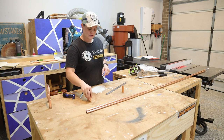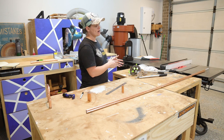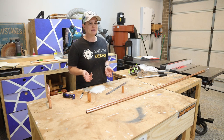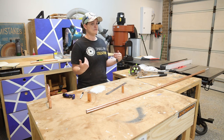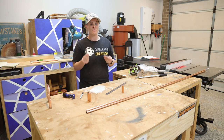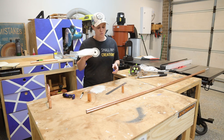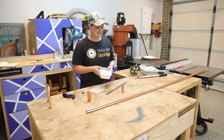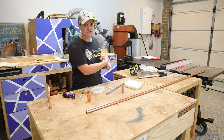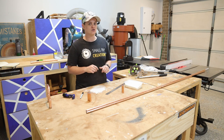I've got my four pieces cut for the bottom of my stand and we're now up to the point where we can start to bend copper, but it's not as simple as just throwing it straight into the pipe bender and going hell for leather. You need to put something in the pipe to stop it from kinking. A lot of people online say you should use sand, but the sand from Bunnings was for a sandpit and it's quite wet — you want it to be dry. So we tested a whole bunch of items and castor sugar worked the best. You can get this from Woolies for like 99 cents. Tape one end so the sugar doesn't go out, fill the pipe with sugar, and then we can start to talk about how we're going to bend it.